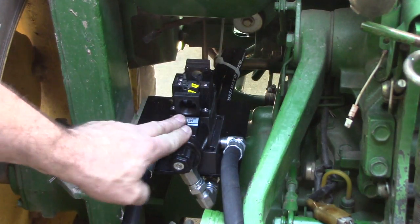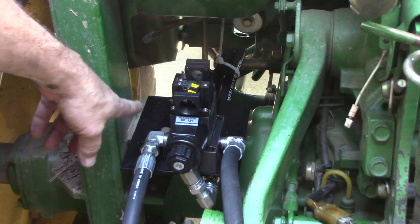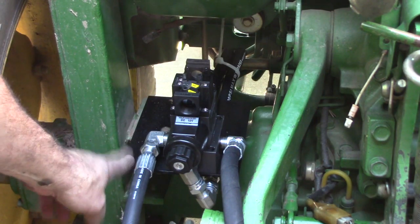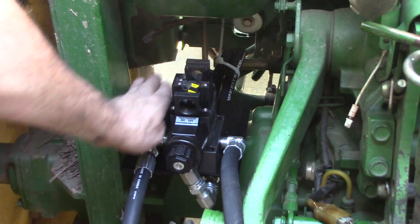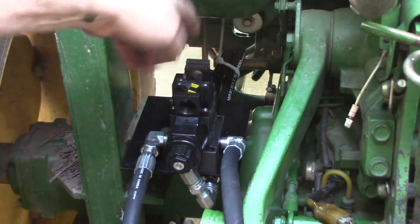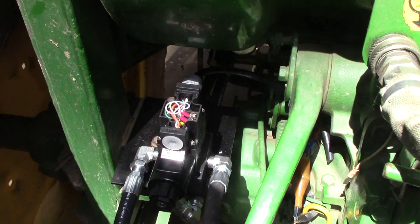So this is the rear of the tractor. This is the control valve for the grapple. Electro-hydraulic, and we're routing the wires on down. I got the cover off right now so I can hook up the wiring. I made a 3/16" steel adapter plate that mounted right where the little toolbox was sitting. I took it off and made that plate to fit right on there. And the 2 hoses go forward. These 2 here are for the back. I hook up the hydraulics back here.